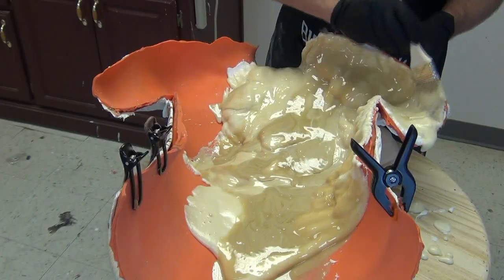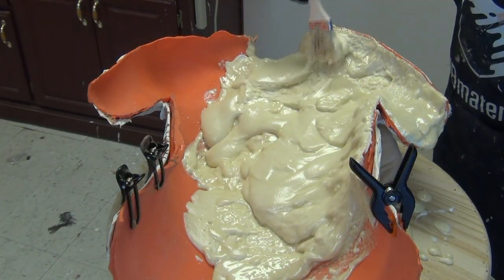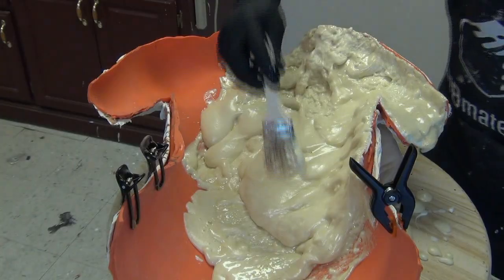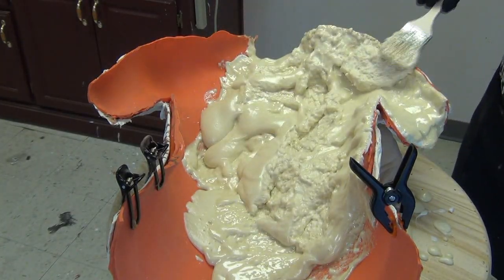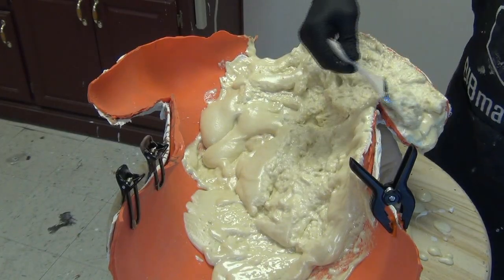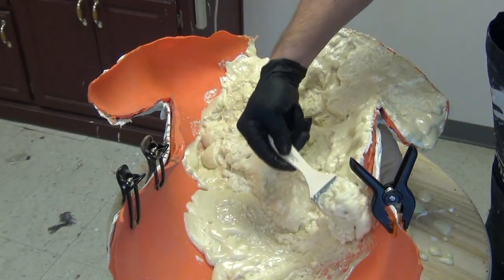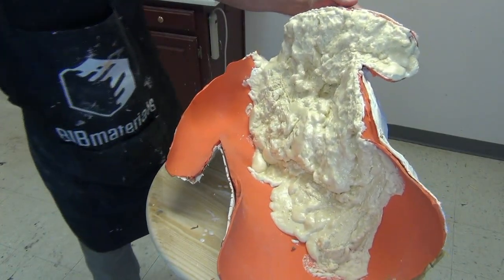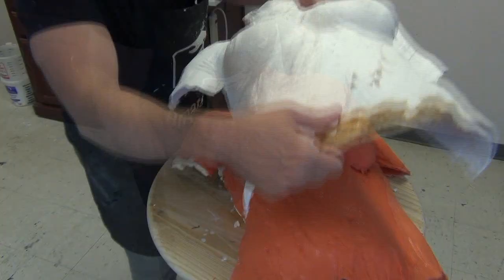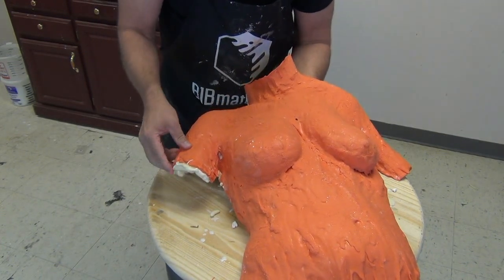I usually put down a large trash bag — a polypropylene trash bag — on my floor under my work table, so those little drips of foam don't stick to my linoleum floor. That's an important consideration because rigid foam wants to stick to pretty much everything in the same zip code, so be very careful about whatever it comes in contact with. Much like the resin, when it starts to get grabby, it's time to leave it alone and let it expand the rest of the way and demold our pattern. Now ready to carefully demold our silicone life cast.